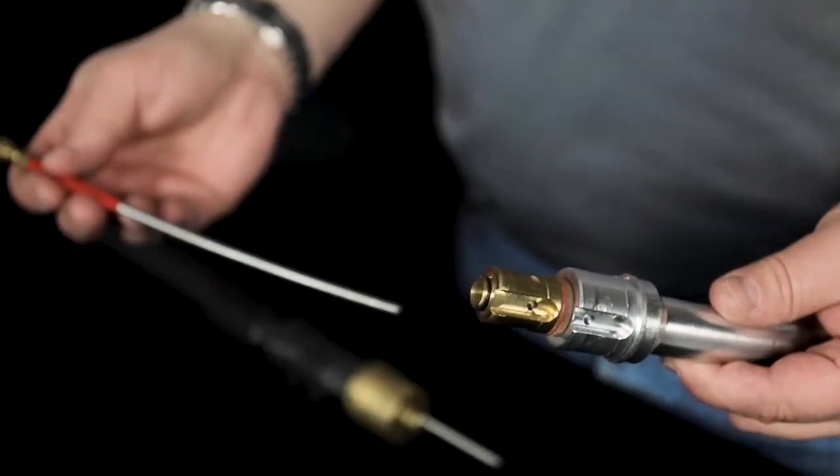The use of neck liners, also known as jump liners, can reduce unnecessary downtime as well. You can have neck liners pre-loaded into torch necks so that you don't have to re-cut your wire liner every time you want to change out a neck. The same goes for cable assemblies. If a cable gets damaged, it can be replaced in a matter of minutes depending on the torch model. And since the torch and torch holder are untouched, TCP remains unaffected.